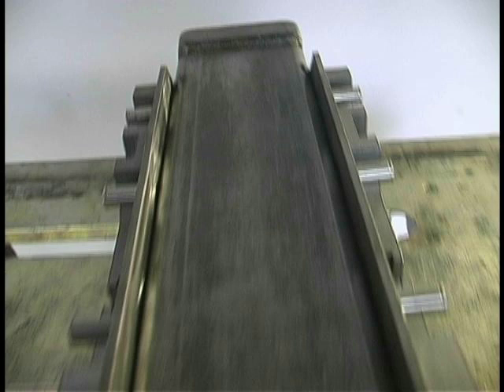I've got to weld all the way around these side plates. The bottom is kind of a flare bevel V, and all I want to do there is just sew it up — I'm not really worried about evenly spaced ripples, I just want to get it done fast. You can see the previous circular weld on the pin where I MIG welded that — it's been ground off. We're going to weld everything and tie it all together with this weld. Not doing much motion here; just making a small, tight weld, motoring on, trying to go as fast as I can. Looks fine.